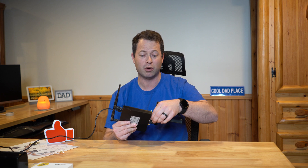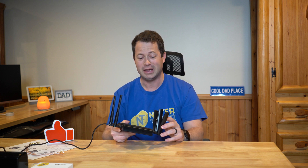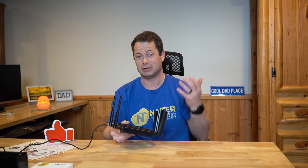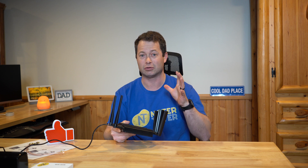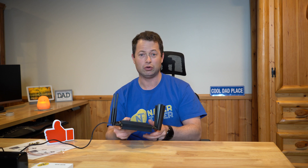That makes it a very quick and easy way to add your own antenna — that's the first big bonus of a unit like this. The type of antenna you choose will probably depend on a couple things. One is your use case: at a home setting you probably want a directional antenna because you know where your best tower is. But if you're in an RV, camping, or a nomad going to different areas, you might want an omnidirectional one.